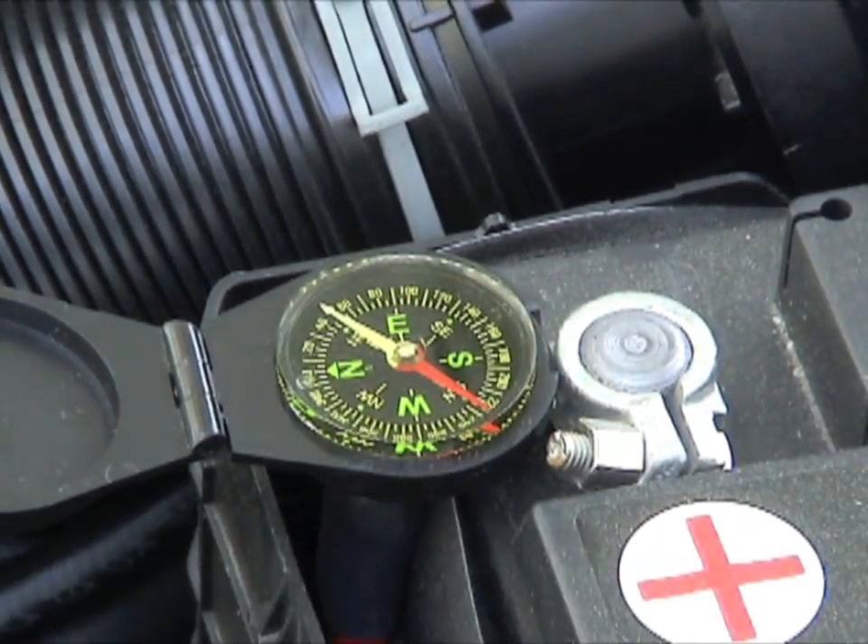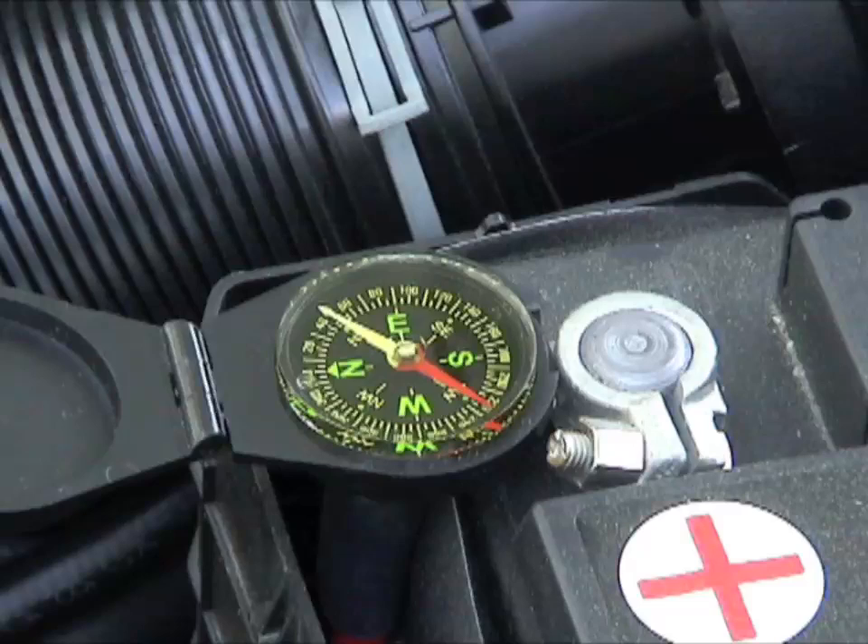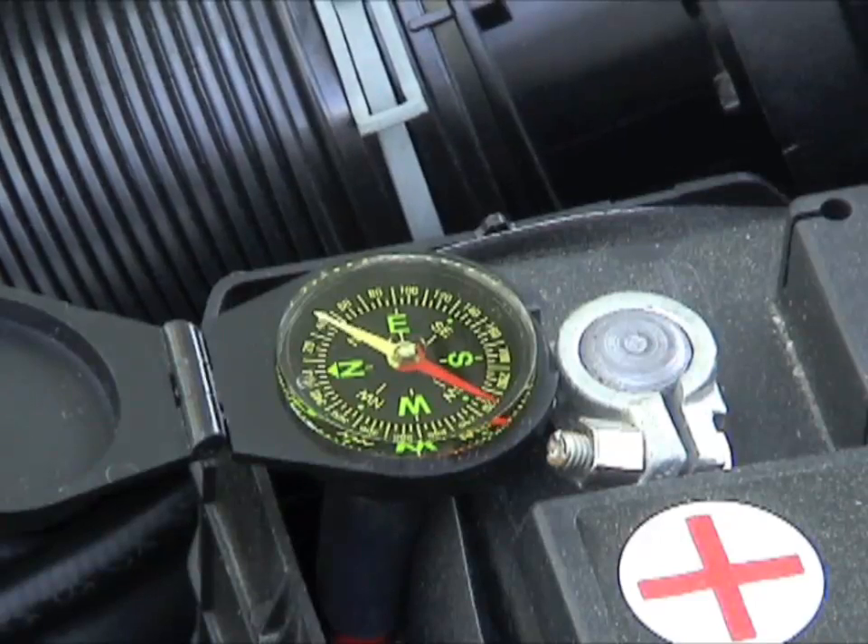During crank, the battery is the power supply. When the vehicle is running, the battery is in fact a load. The only way the alternator can carry a load is if the voltage remains higher than the battery. So as long as the compass needle never swings back, the alternator is carrying a load. This cannot be argued, and is an exceptionally simple and effective way to avoid changing an alternator that is not defective.